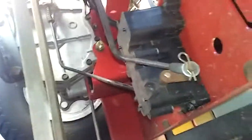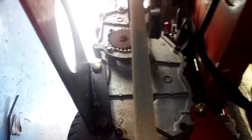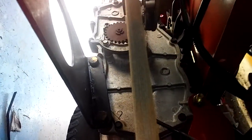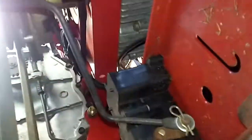You see those rods? There's two of them, one on each side, and if you look they go down to that little horseshoe. What that does is it locks the brakes up — one on each side. So when it's in park and you pull the arms over, those things are supposed to lock. When that module goes out, they lock and you can't move them over.